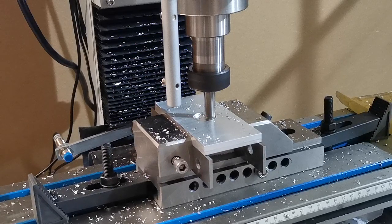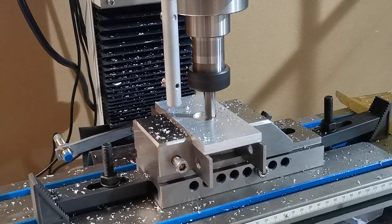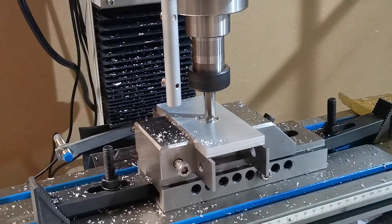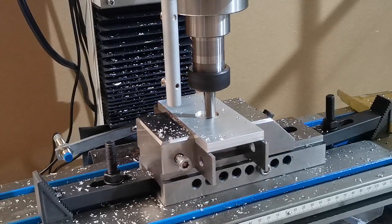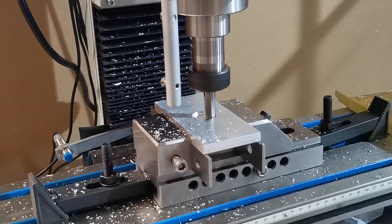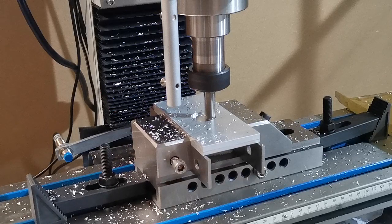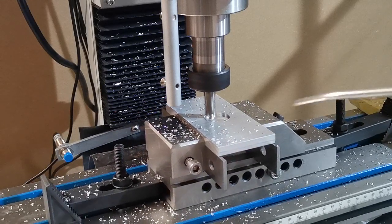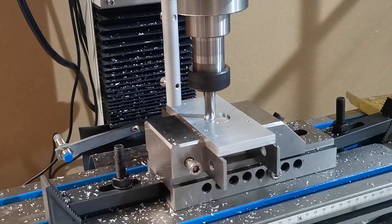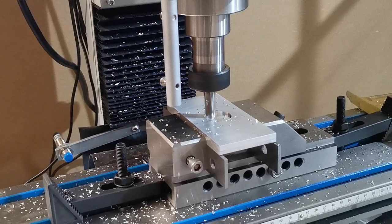You can see this is actually cutting as a climb cut, spiraling down at an angle to reduce wear on the tool. It's now side cutting to make the hole larger, which is the indent for the stepper motor. We have this set at 400 millimeters per minute — people using these machines will be able to optimize that.